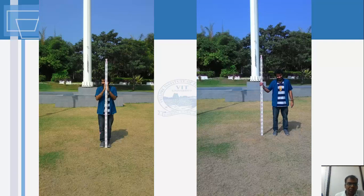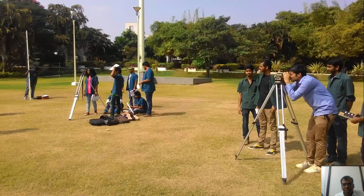This is the correct way to hold the staff — there should be no obstruction and the entire graduated region should be visible. If you keep your hand blocking part of the staff, you risk obstructing readings and causing the staff to tilt. Hold the staff parallel to your body, keep it vertical, clamp it between your feet making a V-shape, and hold on tight. Any other way is wrong.